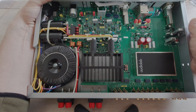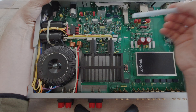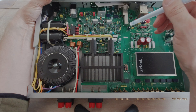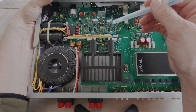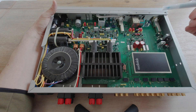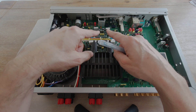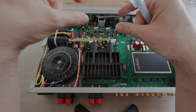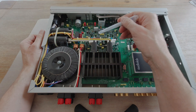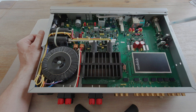You can find replacement resistors rated all the way up to 1 or 2 Watts. The other recommendation is to lift them so the underside of the resistor is not against the circuit board, which would otherwise damage the board and impede heat dissipation. By floating the resistor a bit higher you help it dissipate heat. I was thinking of replacing those four resistors with heavier ones that I will mount much higher on the board — opening them a little like the tail of a bird to help disperse heat between them.